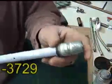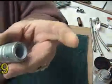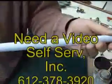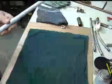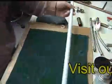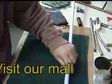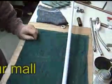The biggest mistake is soldering and heating this up — the dip tube melts and falls off the bottom of the heater. There was also a dip tube recall about eight years ago where they deteriorated and fell off inside heaters — a big recall on them.